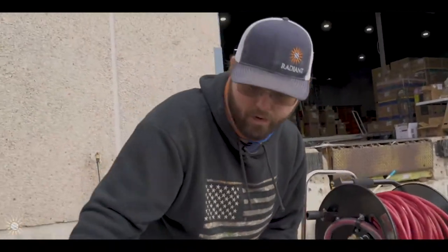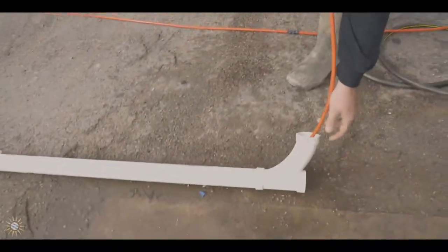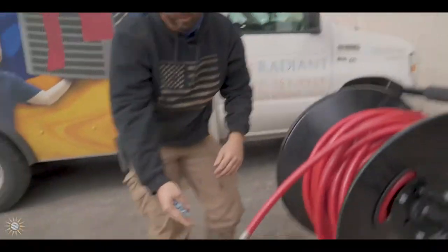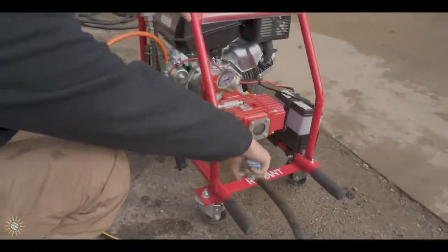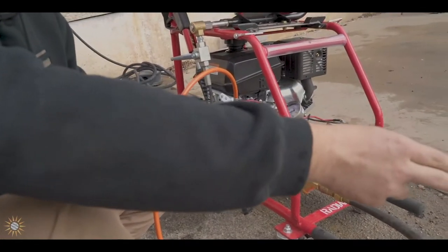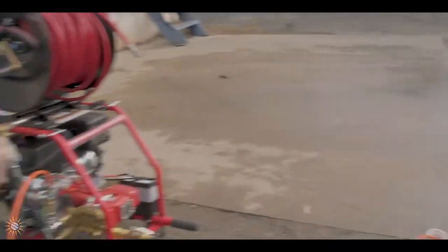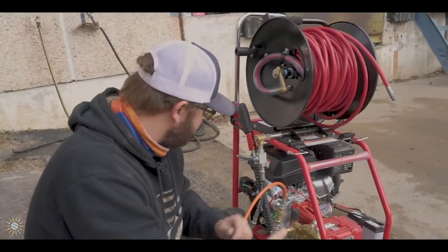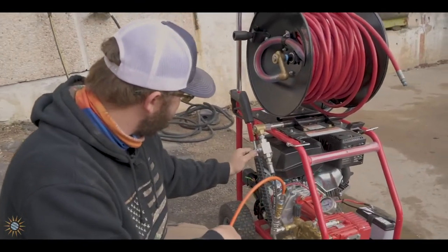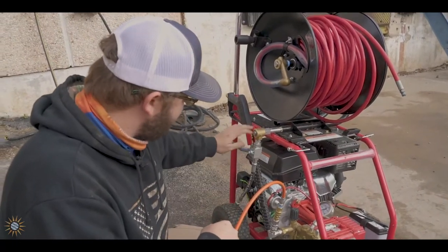Next, check your tip and get it secured inside the drain so you're not making a mess - get it in there a little bit so it's going to flow. Then go ahead and open up the ball valve. Now you're actually pushing water into the pump. It's coming through - you can hear it on the back side. You'll start seeing water come down the drain as you're purging this line of air. You can hear it kind of sputtering. Give it a minute and let it do its thing. For the larger hose it's the same setup - just turn on that ball valve.